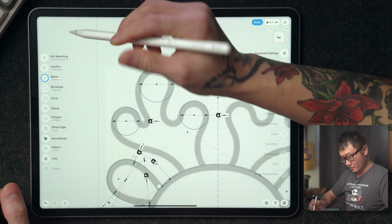Now all we have to do is extrude the sketch into 3D bodies, which I promise is gonna be much quicker. So let's exit the sketch and we are going to extrude the face up 25 millimeters like that. And then remember these sharp edges that we ignored earlier where the head and the cheeks met? Well, now we can go ahead and pick these sharp edges and we are gonna pull away to smooth that out.